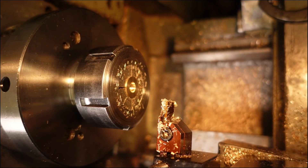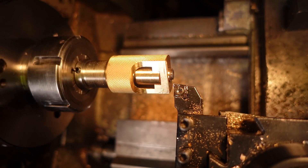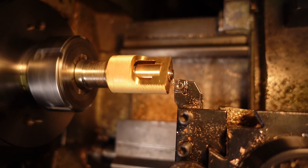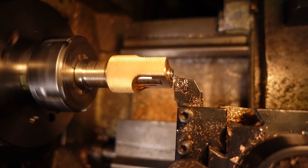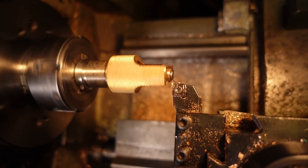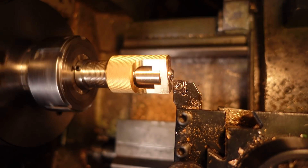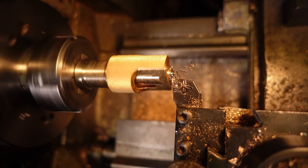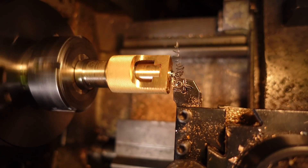Neil is an idiot — as you know already, he forgot to press record, so there's no footage of turning the collet to length. Brilliant. I snipped off most of the excess length of the bolt using a cutting disc on my splendid Milwaukee battery angle grinder. With the lantern chuck mounted in a 20mm collet I can now square off the bolt to the correct length.